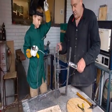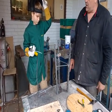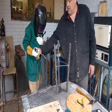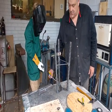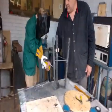So then the next set of welds I want you to do is here. So you go in that corner, and remember you need to lean 15 degrees in the direction you're going and 45 degrees, so you're going right in the corner. Okay.